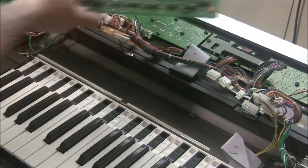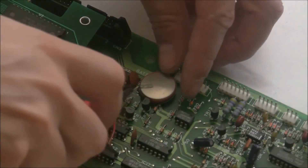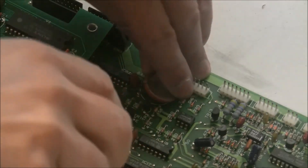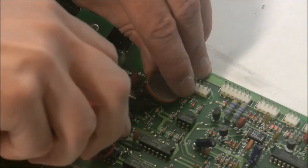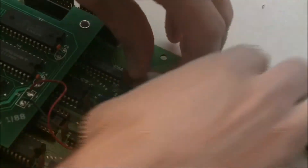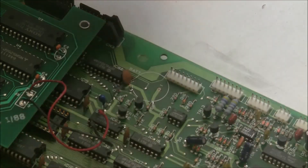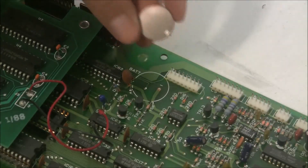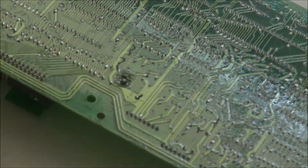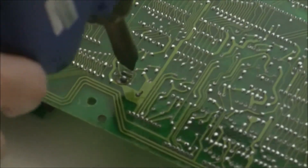There we go. I'm going to trim the old battery off the printed circuit board. I'm going to clip this positive lead, which is exposed, and then slip under there with these cutters and try to snag that negative lead. And now I've removed the old battery without having to apply any heat to it. Now I'm going to desolder the remaining leads, and it looks like someone's been here before and did a not very good soldering job.